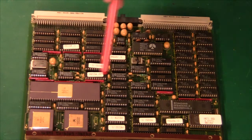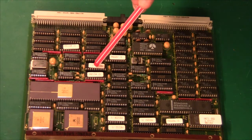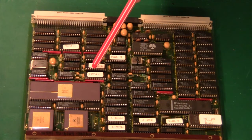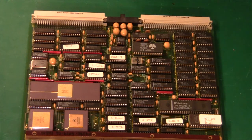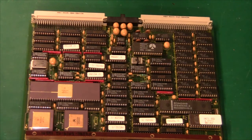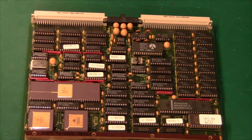Around the CPU we have a lot of TTL gates for glue logic. All these little 16-pin DIP packages contain AMD GALs or PALs — programmable logic. They are often used to replace 74 series chips. Typically they are used for something like address decoding and things like that. Up here we have a lot of 74LS245s, which are possibly used to isolate the bus during a hot plug, though I'm not 100% sure about that.